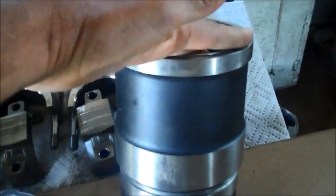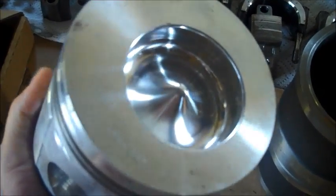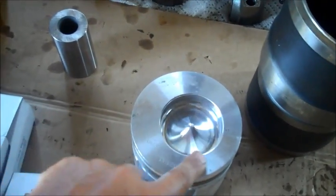We also got this — this is our kit, Vantage engine parts. The kit consists of a sleeve. Here is the sleeve and the piston. It's a crater top — see that little cone in there? That's where the injector sprays and helps break up the fuel. These ones here are flat top. Our other one's got indents on the case where the valves actually go. So you get new pistons, new piston rings, and the wrist pin — that goes through the top of your connecting rod.